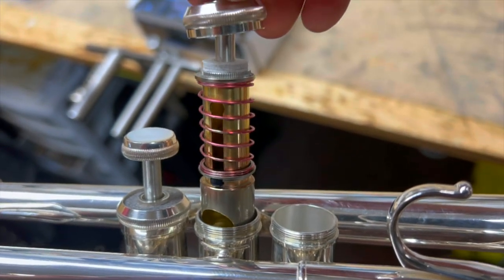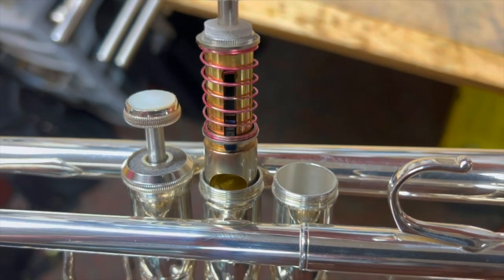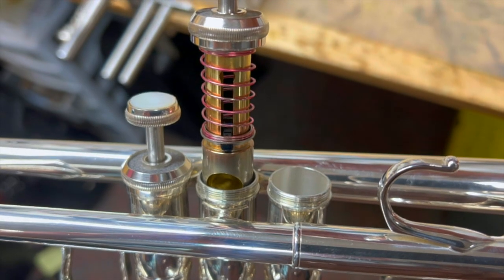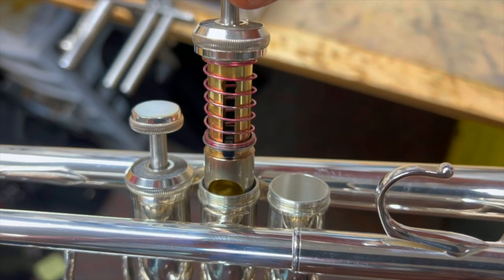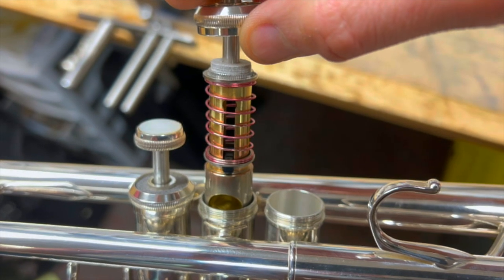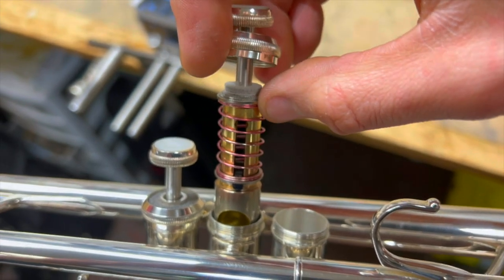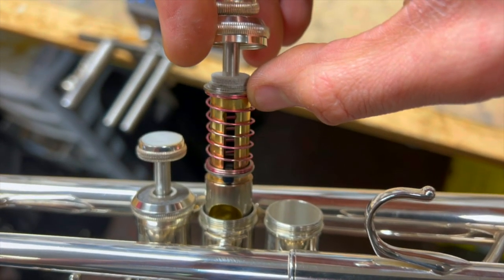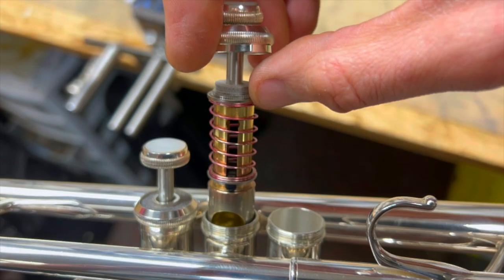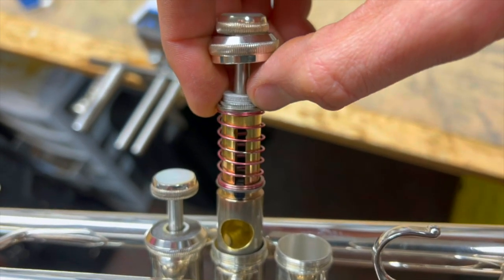There is this little black piece that goes right straight through the spring barrel, and there is no circular interior or any circular base to hold any internal spring. The spring is on the outside now. You might wonder if this is going to compromise valve alignment, because you're going to have a ring up here that sits on top of the spring barrel, seated tight — probably about two thousandths or so clearance of wobble room. But it doesn't wobble around; it's very tightly screwed on between the spring barrel and the threaded valve stem.